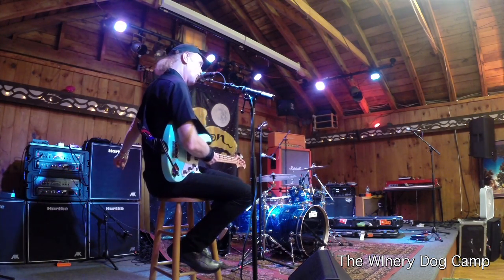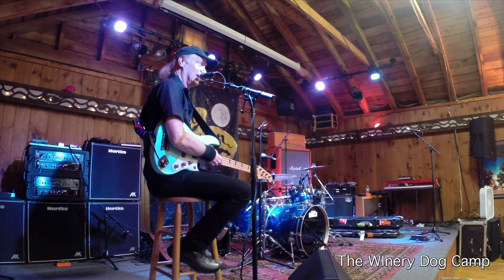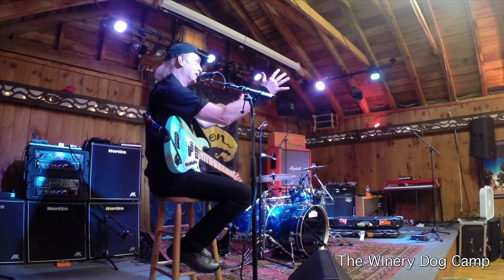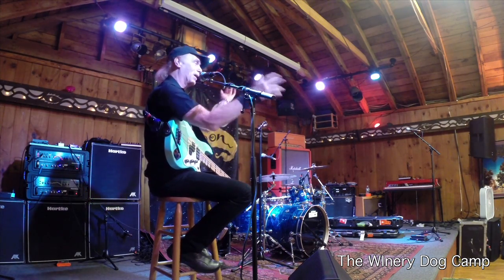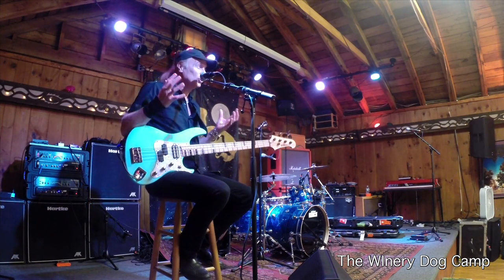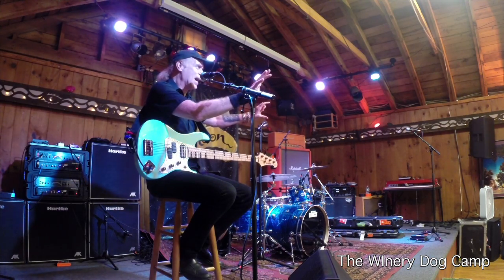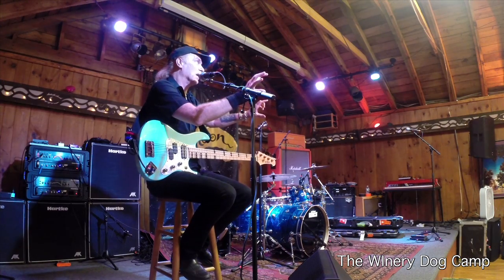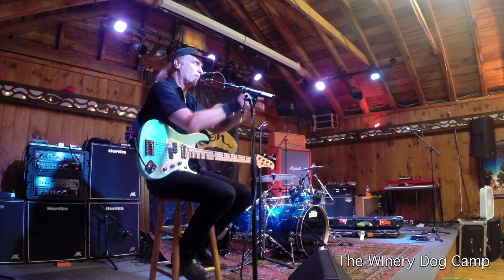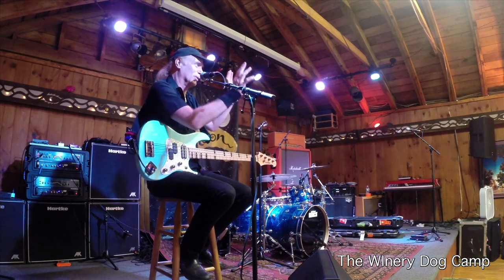That's one of the reasons why I use the 410 cabinet on the lows and the 15 on highs, which sounds backwards. Anytime I go to do a clinic, they always got the 410 on the top, the 15 on the bottom. Nope, take it apart, we got to change it all over again. The reason being, back in the day I used all JBL Pro Audio, BGW power amps, Pro Audio high-end compression, Spectrasonics compression. It was a company that, not the same Spectrasonics we have today, it's a software company, but this brilliant audio stuff, flat from 0 to 100,000 cycles, is crazy overkill.